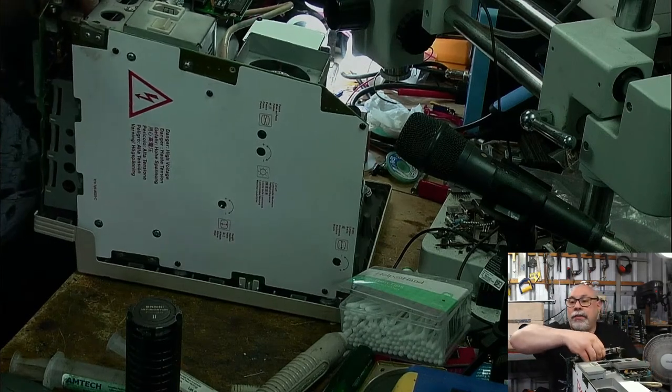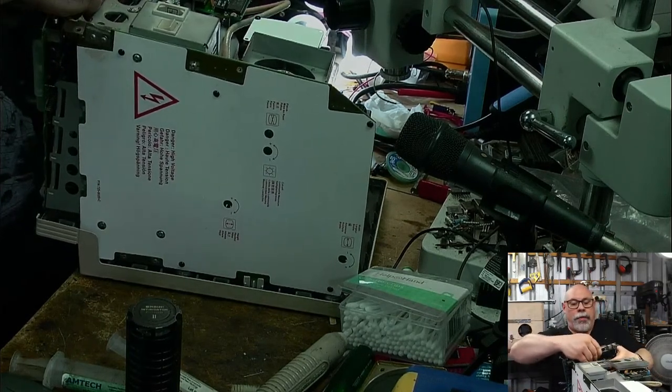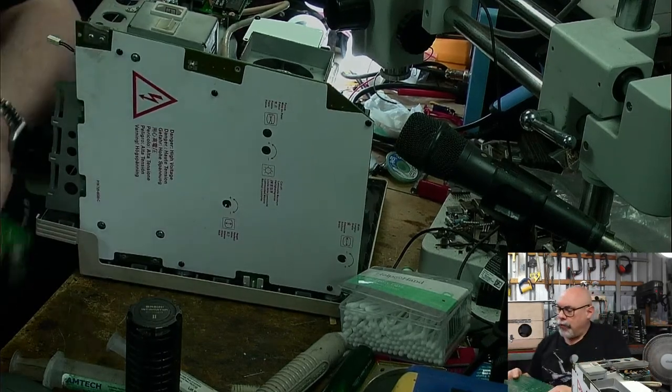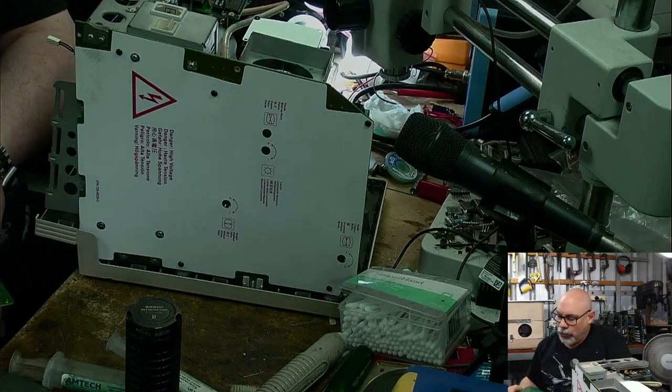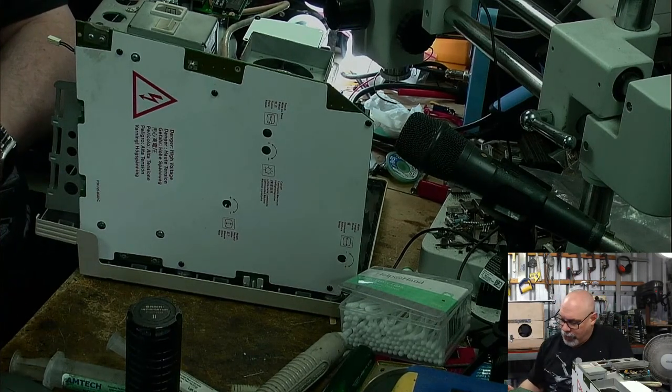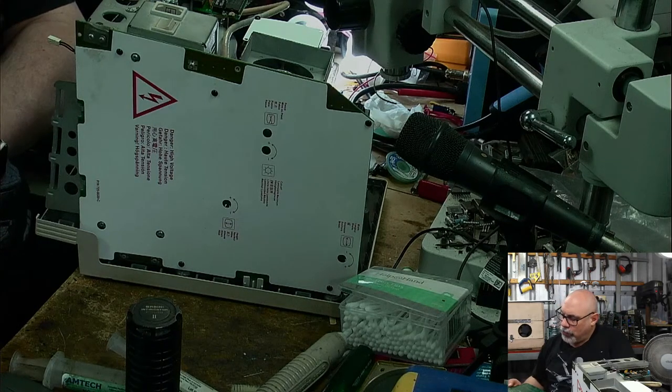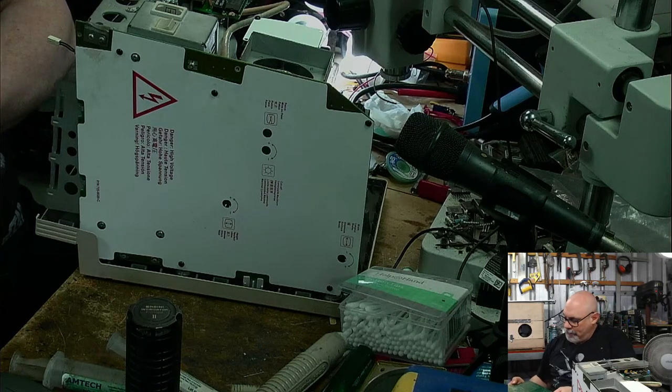I mean, basically, this is exactly what the customer said. This is the problem they were having. Now, I haven't gone in and inspected this properly. Some of the things that I look out for are whether they've accidentally knocked off a component from the back of the board. I've had that happen quite a few times from people that have done their own recapping. And then they're working on the board, they knock off a component. So I'll just see if it looks like there are any missing from here. We did see that we had a damaged trace. We repaired that. There wasn't a lot of gunk on the board, so I wouldn't be too concerned about it from a cleaning perspective. The biggest thing I would be concerned about at this stage is the RAM. So we are going to do something about that.